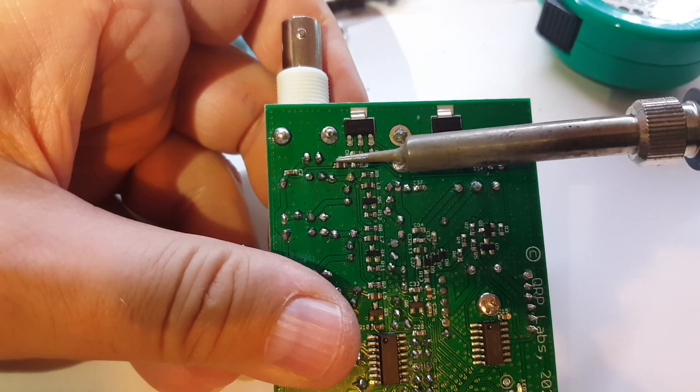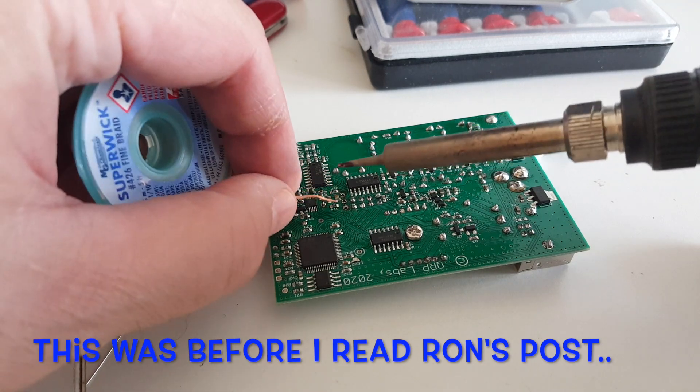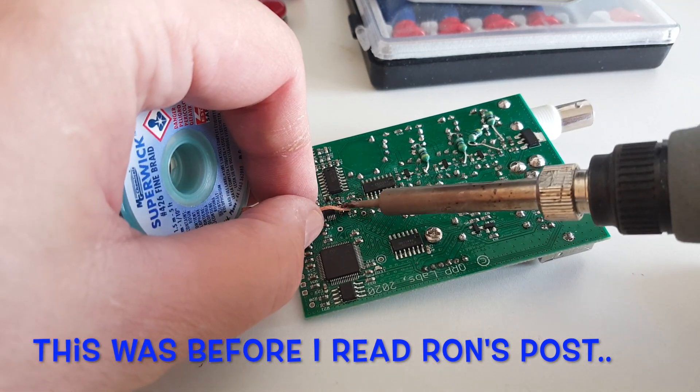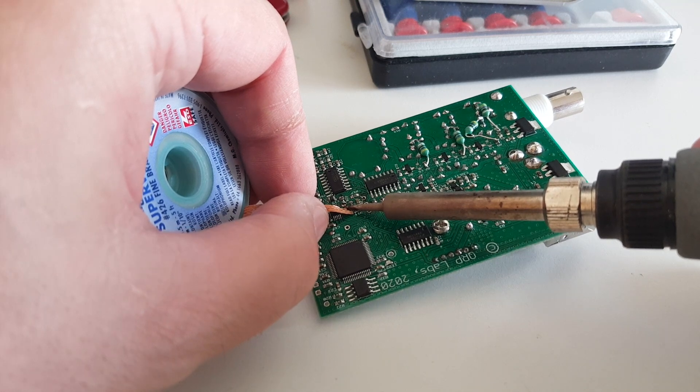I haven't been to the hairdresser yet. I should say that actually Ron Taylor fixed it. He left a comment saying that he just fixed a QDX that had the pads where you have to take off the little inductors and replace them with regular inductors. He said it's very easy to rip off those pads and then rip off the trace at the same time. So I tested continuity and that's exactly what I did — I decided to redo T2. I cut it off and I'm using a solder wick here to remove the extra solder. It's called Super Wick and it works really well, so the board will remain clean.